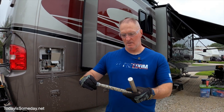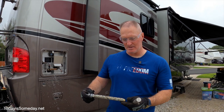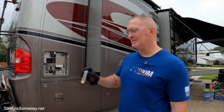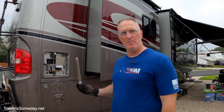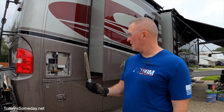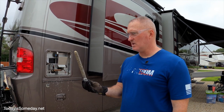We could put it on our list to recheck in three months. This looks like she's still doing her job. This is probably an indication of pretty good water quality, or our water softener is definitely helping with the anode rod. We've had the water softener about six months and this rod has been in there over a year, and I think it made a difference.